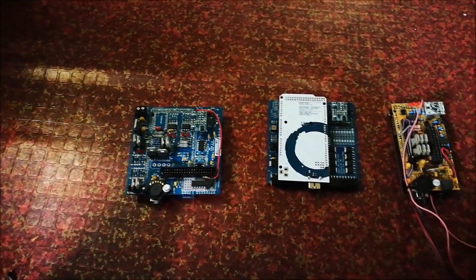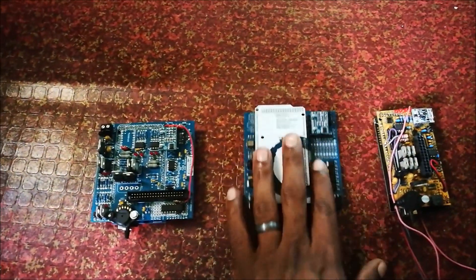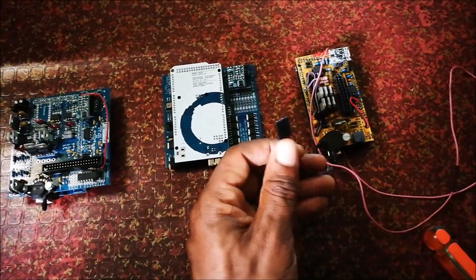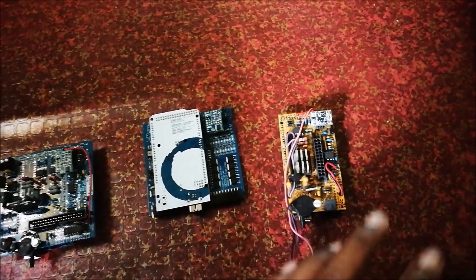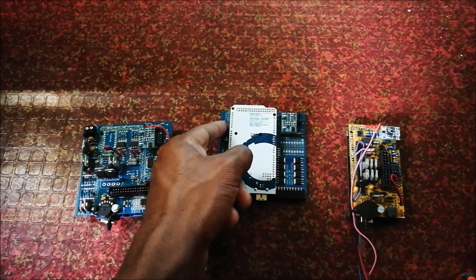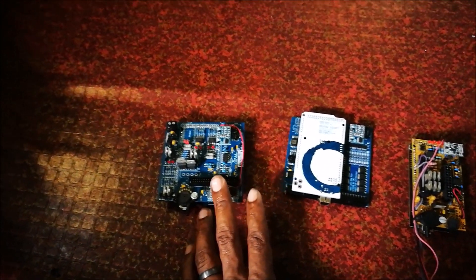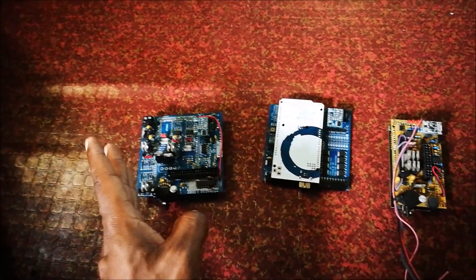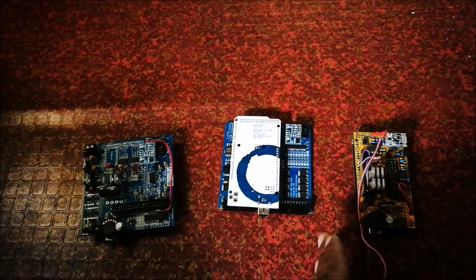The v0.4 does not have an onboard slot or breakout for a Bluetooth module, but the UA4C does. The NO2C doesn't have it built in — I soldered a harness directly to the board, and I have a video showing that. On the UA4C the Bluetooth module can be soldered directly to the board. The latest revision, the v0.4.4, now has provisions for the Bluetooth module, so that was fixed in later models.